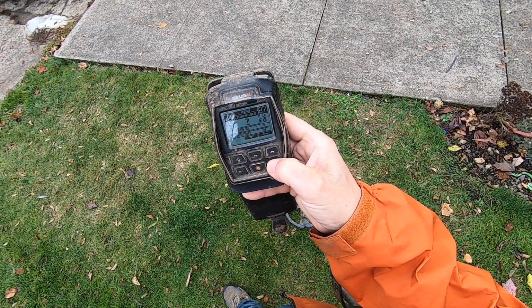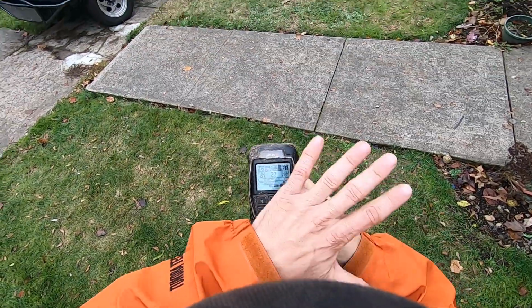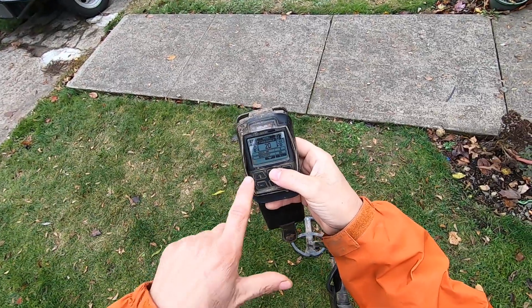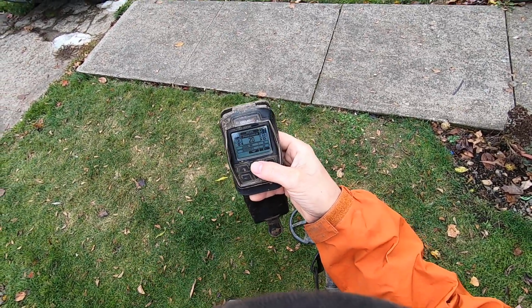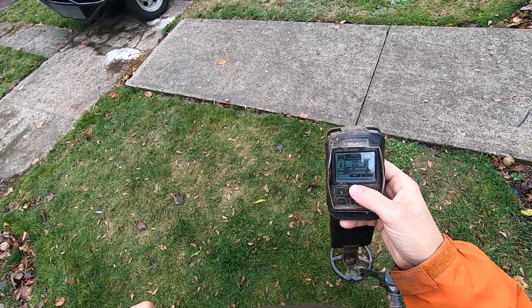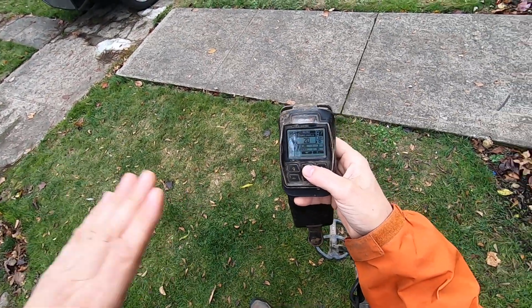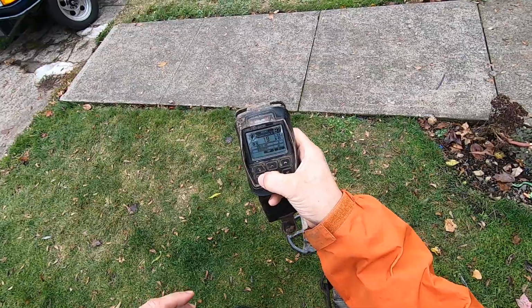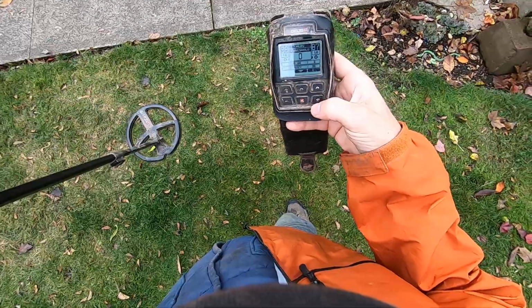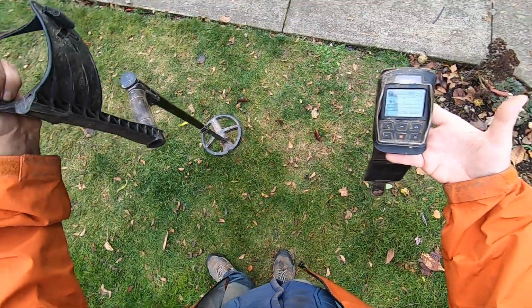I'll go up with it. 20 threshold. Without doing anything, right? Without dropping my gain down, without adding some rejection there. It dropped that interference, that falsing interference, that instability. It dropped it down quite a bit there. So, go back to zero threshold. Right. Very sensitive to EMI.